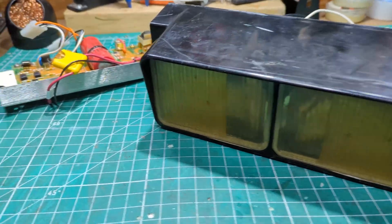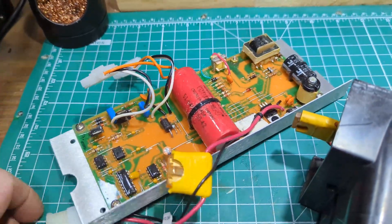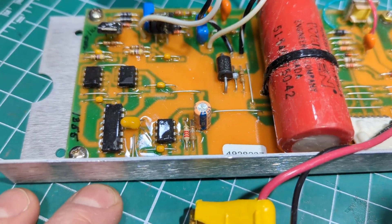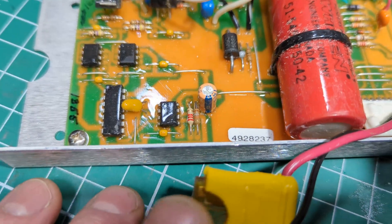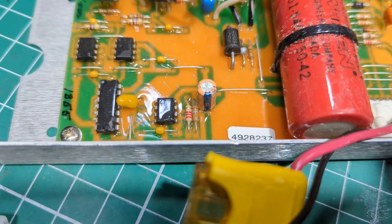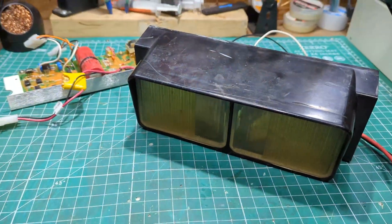These are not technically field serviceable, but our project today is going to be taking a look at the Piercer 2 power supply and seeing how it gets its rate. This is a timing chip board, which means it uses a timing chip, two resistors, and a capacitor to essentially keep time. We can see here we have a 19k resistor on the right, which is the one that we'll be altering to change our flash rate.